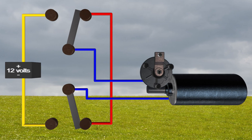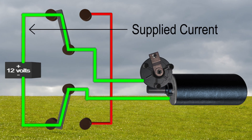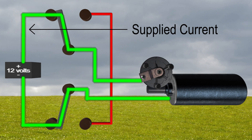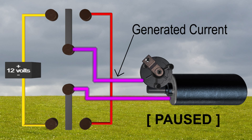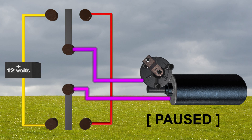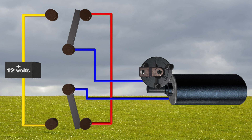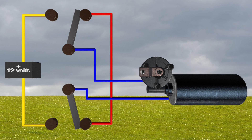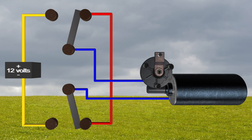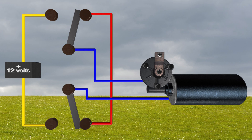It's virtually impossible to see what's happening in real time, but if you slow things down you get a better idea of what's going on. When the relay first throws, nothing happens until the normally open set of contacts connects and electricity is introduced into the motor, and naturally the motor starts to spin. The tricky part comes at the end when the relay drops out. As soon as the relay contacts open, no more electricity is introduced into the motor and the only thing that keeps the motor going is its own momentum — at that point it's becoming a generator. Once the connection is made on the normally closed contacts, the motor's output is shorted back into itself and it immediately tries to drive the motor in the opposite direction, effectively stopping it in its tracks. In real time, the switching time between when a relay moves from one set of contacts to the other is very, very short — only in the order of a few milliseconds — so the motor hardly has any time to coast at all. That's why it appears to stop almost instantaneously.